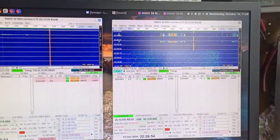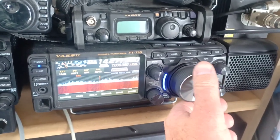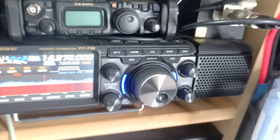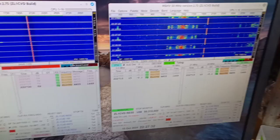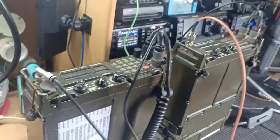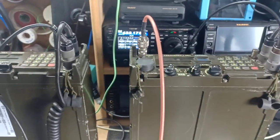We can see it's been decoded. We can turn this up to confirm. It is working — in encrypted mode we've been able to send a signal from one transceiver to the other. It also works in plain text mode, but as I say, due to that vocoder delay some digital modes won't work. That's something I found quite interesting — I didn't think it would work at all because of the vocoder delay, but it has worked surprisingly well. Thanks for watching. Cheers.